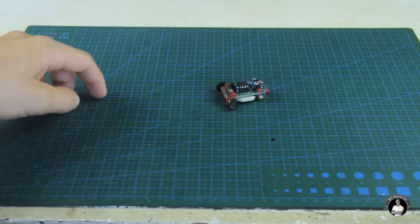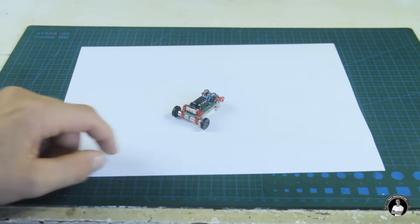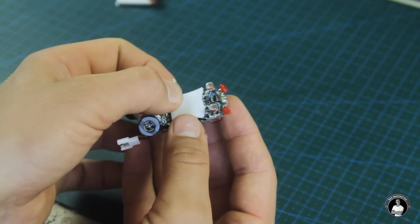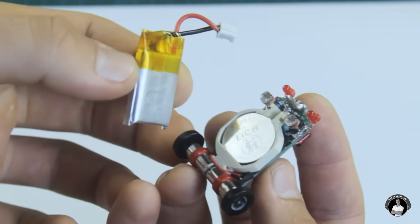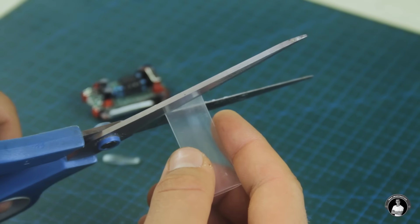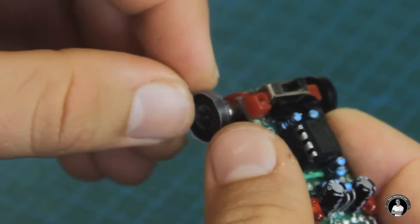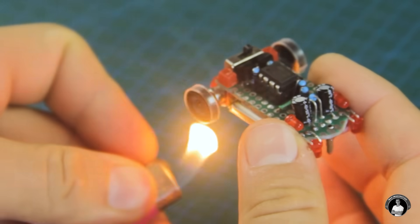Another tip is to replace the current ballpoint tip for one with a larger ball. After a few attempts, the coin cell battery didn't seem to supply enough power to the ungeared motors. So instead of the 3 volt coin cell, using a rechargeable 4.2 volt lithium polymer cell will definitely make it move if everything else already works. To make the wheels grip better on a smooth surface, a bit of heat shrink wrap tube around the buttons will do the trick, as if adding tires.